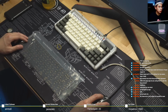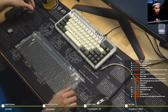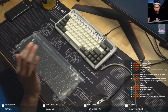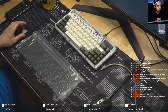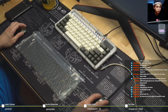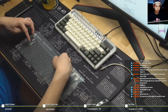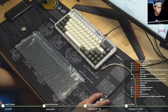No, there isn't a cut to allow for access to reset. Oof. If you are an S7 Elephant owner and you are watching the stream, make sure you have a reset keycode programmed somewhere on your board. And just kudos to you, Mudkip Mao. I noticed in your code you actually enabled Boot Magic Lite, which means you can hold the escape key and plug in your board and it will go into bootloader mode. So thank you for doing that.